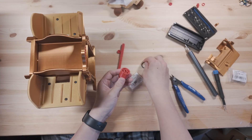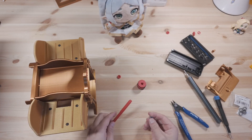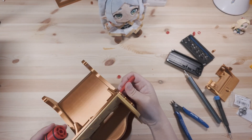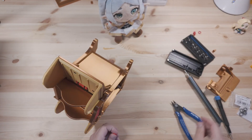Step 3: slide the O-rings onto the roller pads. Place bearings onto the shaft ends and secure them with the end caps. Insert the drum and slide the shaft through the body. Secure it with a set screw — don't over-tighten.